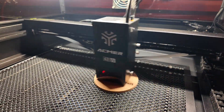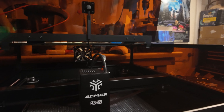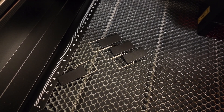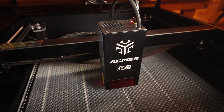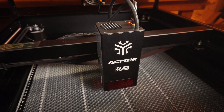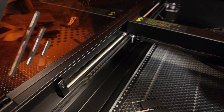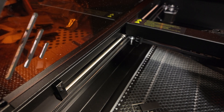Now let me give you an overview of the Acemer P3 and the different functions and buttons on the machine. It is a 400 by 400 work area and it comes with a honeycomb steel bed and four magnetic hold-down options, giving you lots of versatile ways to hold down your material. The laser module is swappable, so you can swap it out for other Acemer laser modules. It has an air assist that plugs into the top along with the power connection. The laser head does not adjust on the Z axis, so you have to move it up and down yourself using the screws on the side to lock it in place. The X and Y axes are belt driven on a metal rail system, which helps prevent flex at high speeds.